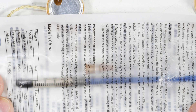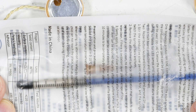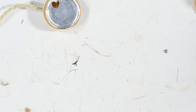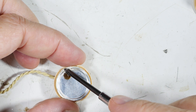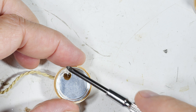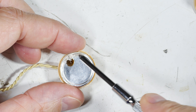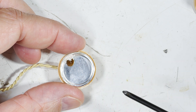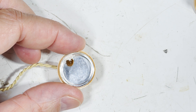You buy some of this liquid solder — this is not the junk you buy at the hardware store, this is stuff you get from a specialty electronics store. It is two dollars for 4.5 milliliters. You put a little dab right there where the wire crosses the diaphragm up on top, and so far it's worked. But I'll be honest, I'm not impressed — the resistance is really high and I don't know how long it's going to maintain that contact.